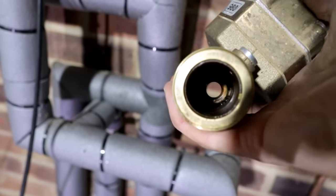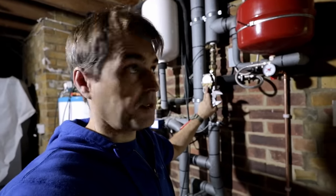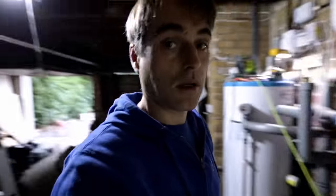I'm going to check if there isn't a blockage in any of the components on the pipework, disassemble it and have a look, and then maybe have a look at the external unit heat exchanger again because I tried to unblock it unsuccessfully. I took a component out, replaced it with a bit of pipe, and it made no difference to the flow whatsoever.